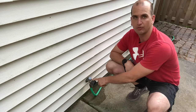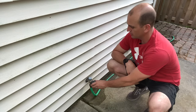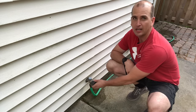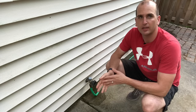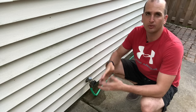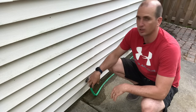What's going on is this outdoor faucet or spigot. The top anti-siphon valve, or vacuum breaker valve — when you turn it on, we get leaking out of the top of that valve. There is a small plunger that goes up and down. When you turn it on it should seat and no water should come out, but when you turn it off it does let air go back through and creates a flow path so you don't get a siphon effect which would pull water back into the clean water supply.